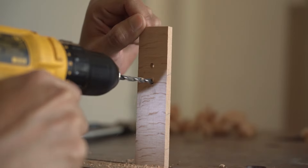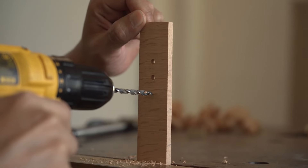When putting in toe kicks, good installers are great at concealing nail holes. You have to drive nails through the corner rounds to secure them to the cabinets or floor, but the good ones hide those nails using putty and touch-up paint, leaving everything completely paint-ready. Mediocre installers will tell you to send your painters to fix it — but that's not the painter's responsibility, it's the installer's.